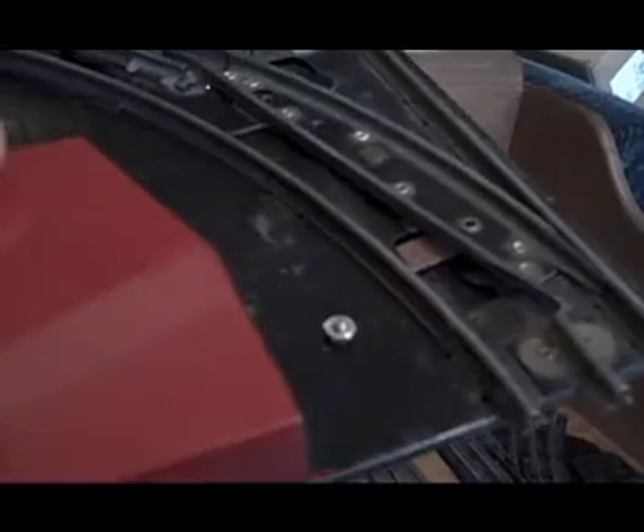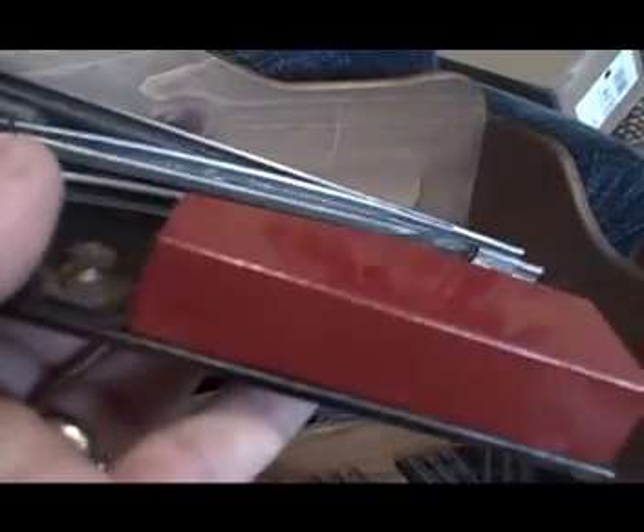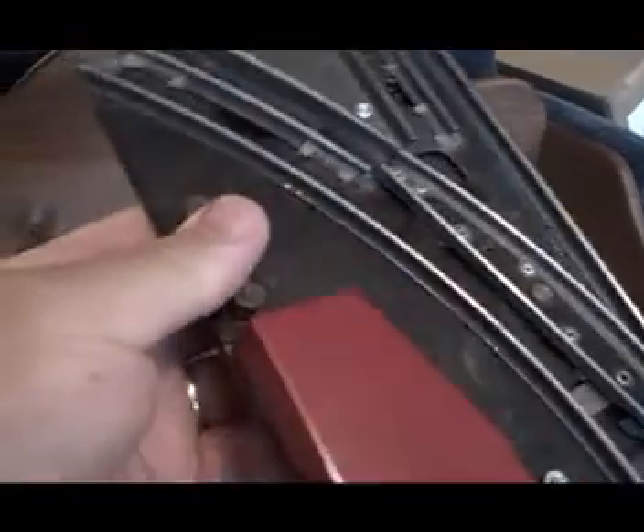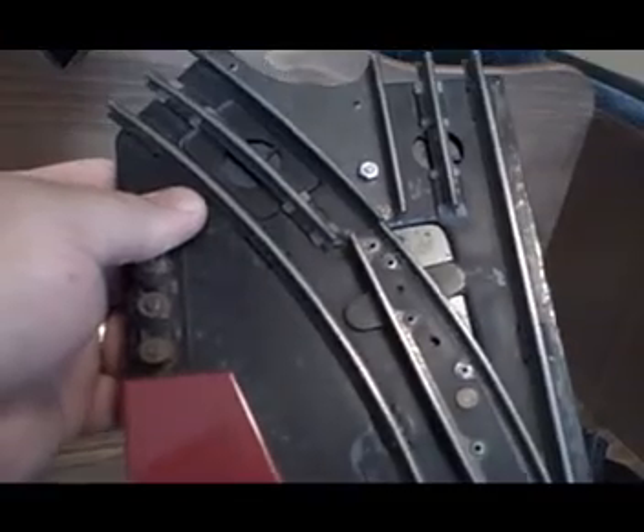From this profile you can see they're so small and low profile it's not going to interfere with the train. What's nice too is if you ever need to service the track again — if you have a wire problem, because some of these are really antiques — you can get that apart very easily. Also, in order to paint this properly, it has bend-over tabs on the inside which I'm going to show when I take it apart.